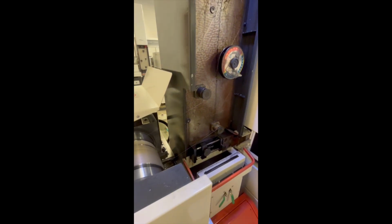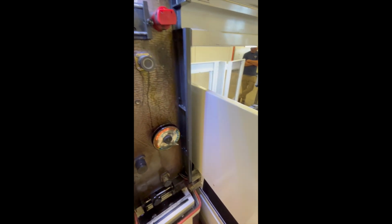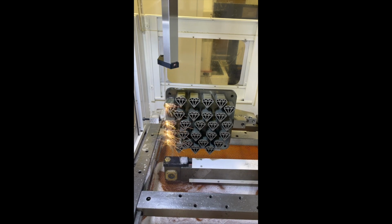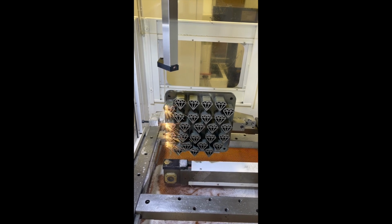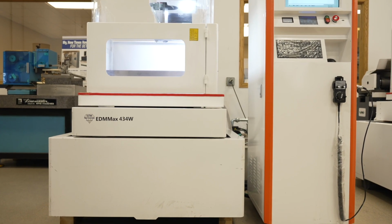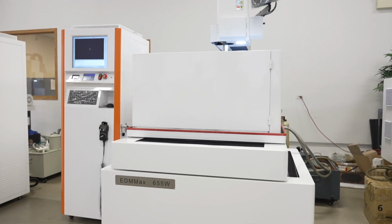Unlike conventional wire EDMs, this moly wire is reused continuously. Typically, this 7/1000 of an inch moly wire will last about 25 to 40 hours of continuous cutting, depending on the project, at a total consumable cost of $1 an hour. We offer these FastWire EDMs in 6 different sizes and configurations. We offer both vertical models and horizontal submerged models.